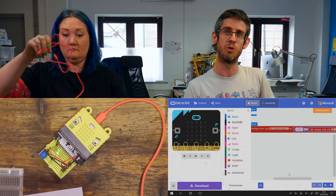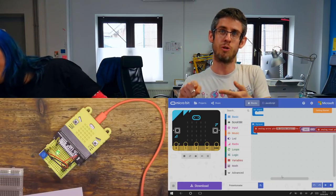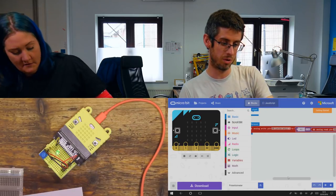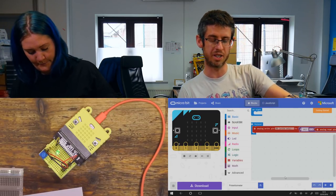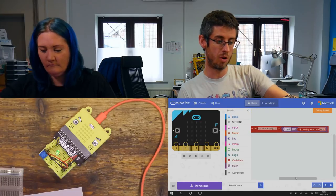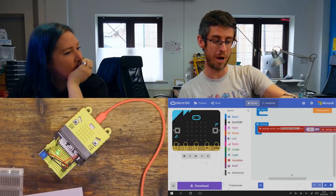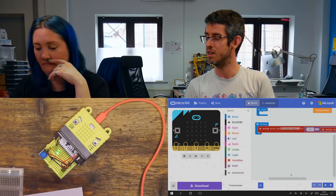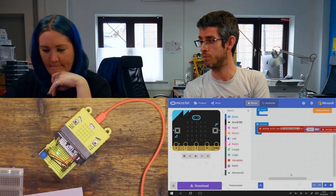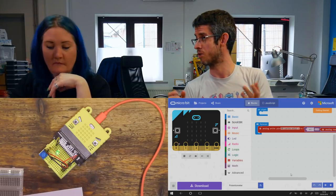This is the simplest kind of demo that you can get. Essentially, we've got a potentiometer, the output of which is going into analog zero. And then there's an LED that's connected up to pin 8. The analog value of the potentiometer has basically just been passed into the analog value for that LED. So when you turn the potentiometer, the LED gets brighter or dimmer. And you could obviously replace that potentiometer with any kind of analog input or sensor or whatever you wanted.